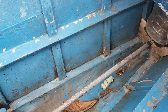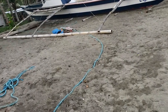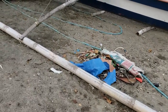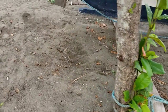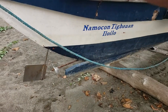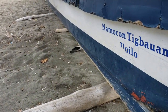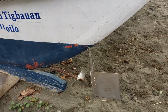So it won't want to start once again. You have an alignment issue. Let's walk over here to Crystal Gale and I'll show you another thing on that shaft that could be a problem. You're not the only one to experience this — I experienced it myself. I had some guys do some work and experienced the same problem: the boat didn't have power, it was hard to start, and they said it was blowing a lot of black smoke. It was all because of shaft alignment issues.